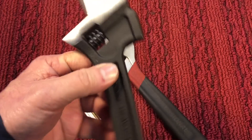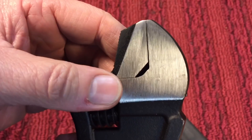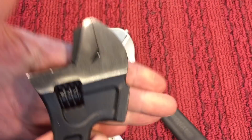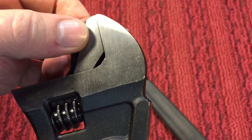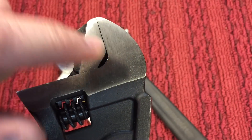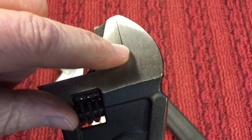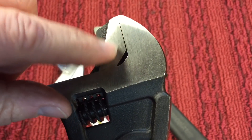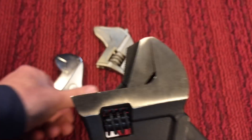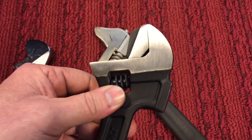Over here, this is a brush finish you would get pretty much right off the sanding belt. You can see they touched the belt like this, and that left that finish. This is a nice finish because it looks decent and it doesn't hold fingerprints. However, little microscopic grains of dirt, oil, water, and sweat could get in there, and that's what could cause rust. It would be a lot easier for this particular finish to rust than it would be for the polished one. Those are considerations you have to think of.